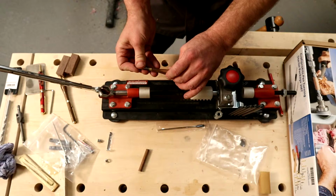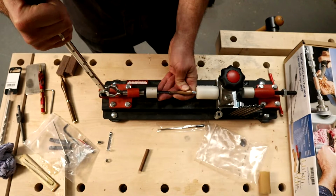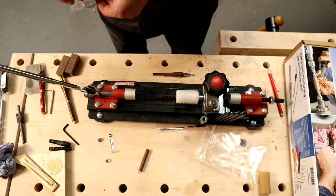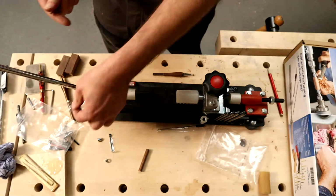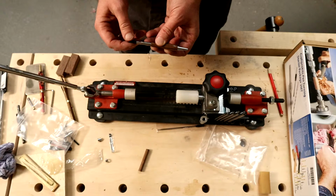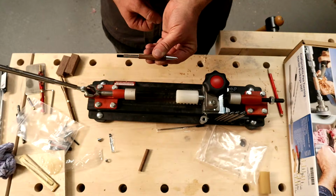Let's get that located. Again, we've got a little chamfer or location bit on that twist mechanism. Then we're just going to push that over up to, and not past, that little indent. Nice control on something like this pen press. Now's the time to check the refill is in the right position. So that goes through. Again, sometimes they'll just get snagged, so nice and gentle. We can screw that in, and as we twist that part, you see the nib protract and retract. Good.